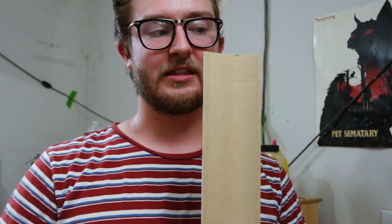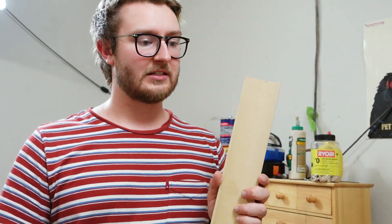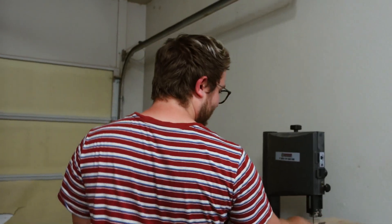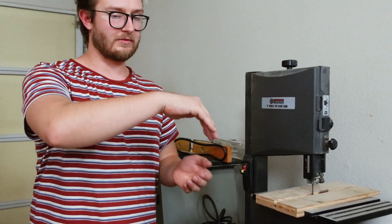What we've been doing recently instead of dowels — which we did on our first dresser — is cove cuts. I actually have one over here; this is the rough batch, like the first trial we did. This is a cove cut, and one thing I'm considering is selling these on our Etsy instead. It would be kind of the same idea: a simple way to totally transform a bland piece and give it a ton of character and style. So let me know if you're interested in that. The band saw is also fantastic for creating round cuts — even if you can't get a perfectly round cut you can cut tiny angles and sand the rest down, which is great for making rounded legs.